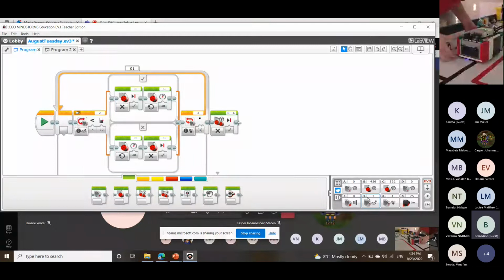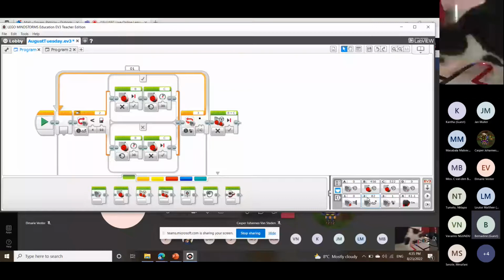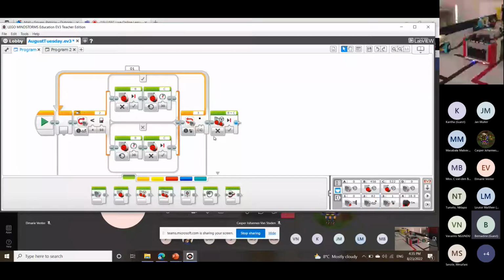It's actually 7. Now if Sylvia puts the port number 2 sensor onto the white of the surface, now it gives you 82. All right. So you have 82 and 7. You add the two together, you get 89. 89 divided by 2 will give you 44.5. Sorry, the cat's in front of the screen. And so that 44 is that value there. That is your threshold value. So that'll make a more accurate line follow because you've already calibrated your line sensor.